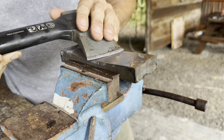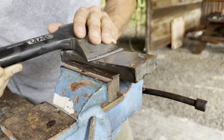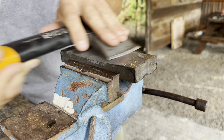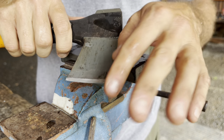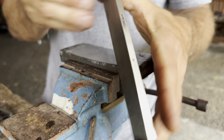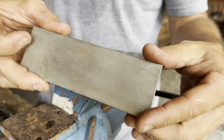I start here kind of steep maybe, and then I'll slowly start flattening out as I'm working — back and forth — and that keeps that convex edge the way that I want. Normally with good axe use, you don't have to do this much. Typically I'll just take a diamond stone and hit the edge of my axe after using it, and it touches it up and gets it back to brand new.